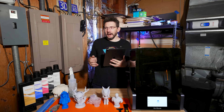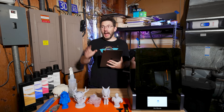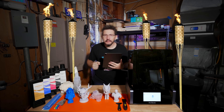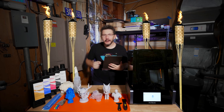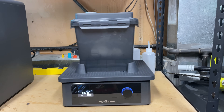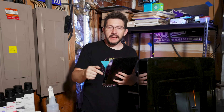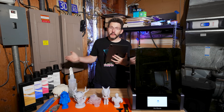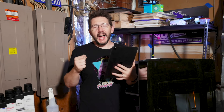The wash station uses a Hawaii chair-like motion — a gyrating movement to clean printed models. What's great is that the same print file you sent to the printer can also be sent to the wash station, and it pre-programs the speed and duration needed to wash the model you just printed. This works because the print file contains the settings for the type of resin used.